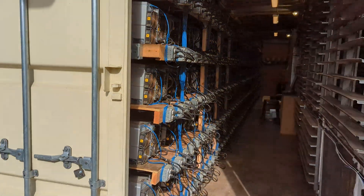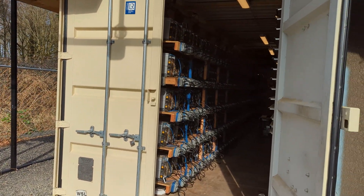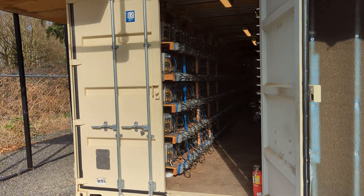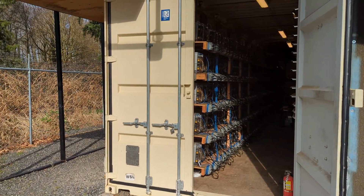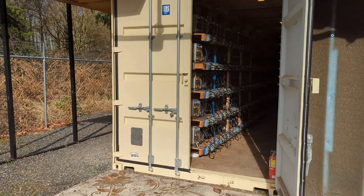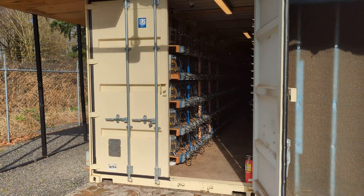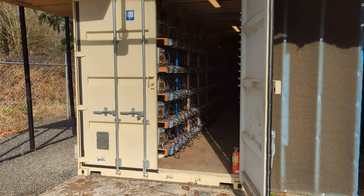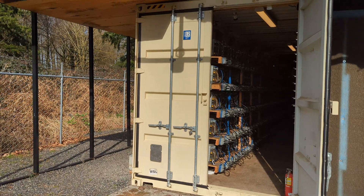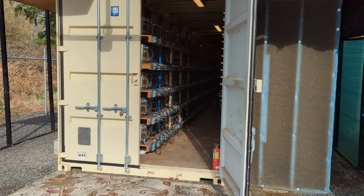The S17 Plus is running on Brains at 2600 watts and 67 terahashes, so we're improving the efficiency. The original rated hash rate of those S17 Plus is 73 terahashes, but in reality they actually do 75 and they use 2980 watts. We're lowering that down to 2600 watts — I've already measured it at the wall and it's exactly 2600 watts — and terahashes is 67 to 69 around there.